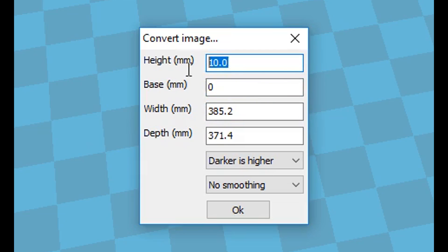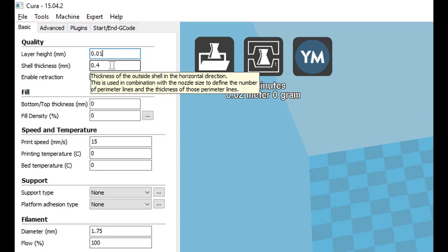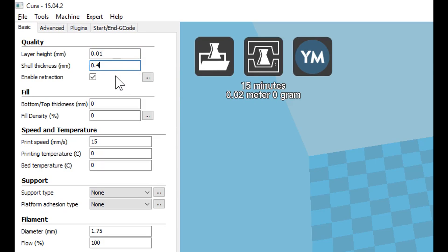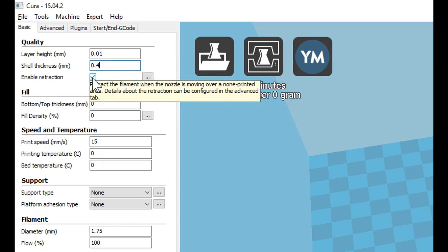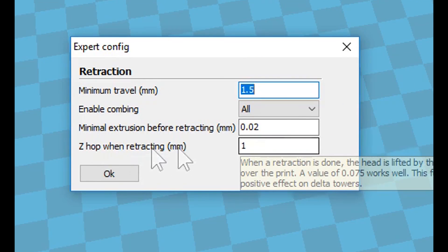Set the base to 0, but the height will be a multiple of the layer height. I use 0.02mm for the image height, which will provide 2 layers when plotting at a 0.01mm layer height. Also adjust the size of the image. For our settings, set the layer height to 0.01mm. Set the shell thickness to the same as the nozzle — we don't have a nozzle, we have a ballpoint pen, but I'm keeping it at 0.4mm as that's the approximate line width produced by the pen on paper. We definitely want to ensure enable retraction is set, and we want to lift the z-axis when retracting. So I'm lifting the z-axis by 1mm here, so the pen doesn't draw across the paper when moving from location to location.